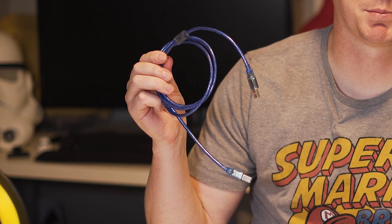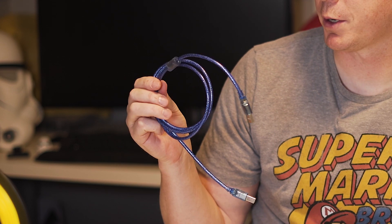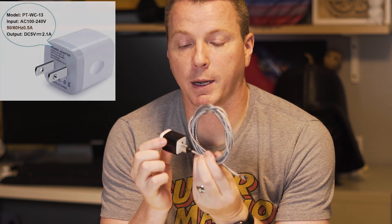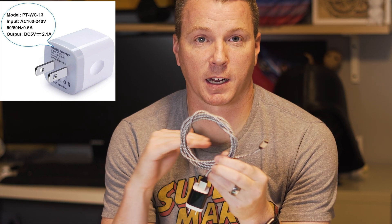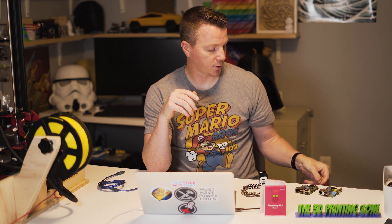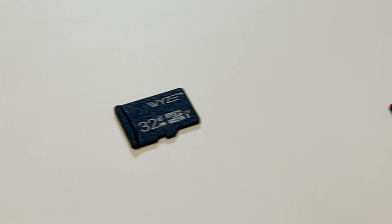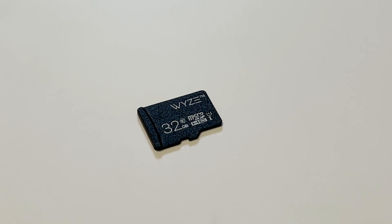These are super handy, not just for 3D printing, but for a million other things too. In addition to the Raspberry Pi itself, you're going to need a few other things — they're all pretty common and you may already have most of them. The first is a USB-A to USB-B cable, and these come with most 3D printers. You'll also need to power the Raspberry Pi via micro USB — ideally a brick with one or two amps for a consistent power rate. And lastly, you're going to need a micro SD card. This is what we'll use for storage to store the OctoPrint software. I usually run 16 or 32 gigs, because if you do time lapses or save files to OctoPrint, it's going to save them all on this little device.